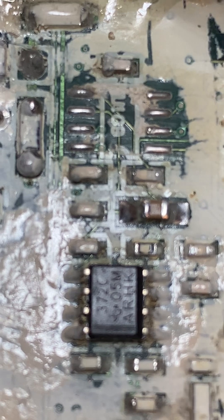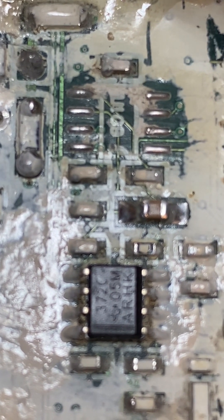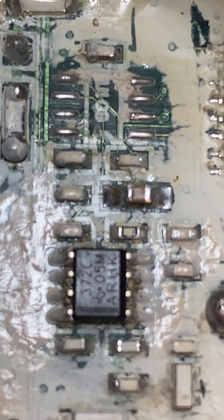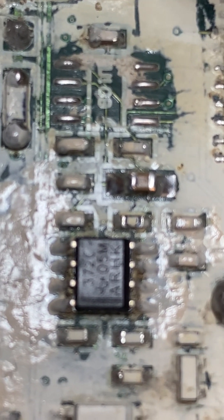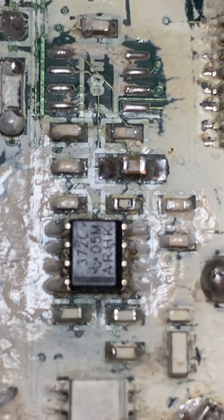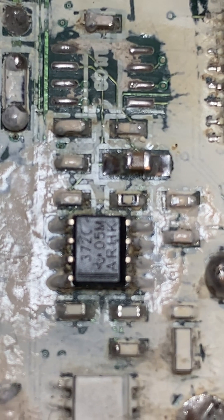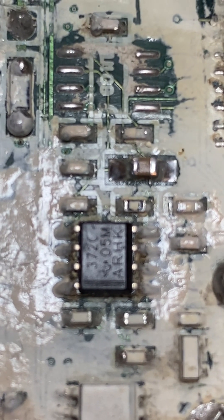Because these comparators are CMOS, they're very sensitive, and it becomes conductive very very slowly — it's millions of ohms — but it's enough to turn the detector off. I've had this happen before, same thing. So if your detector stops working, it's possibly you need to pull that TLC 372 off the board and give it a good clean out.